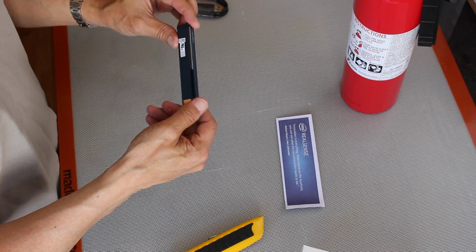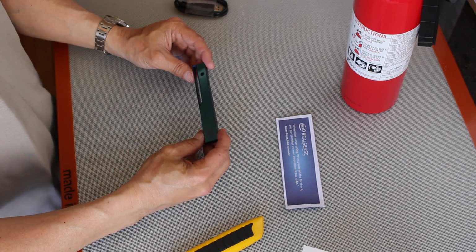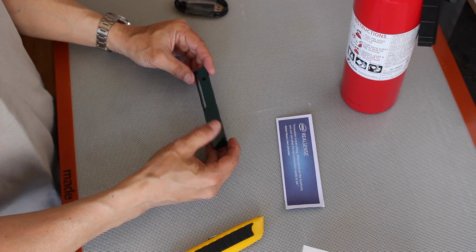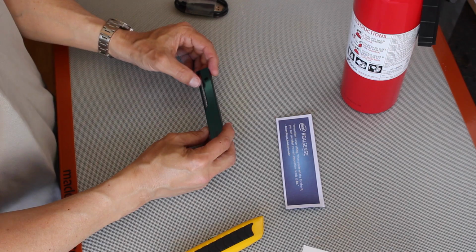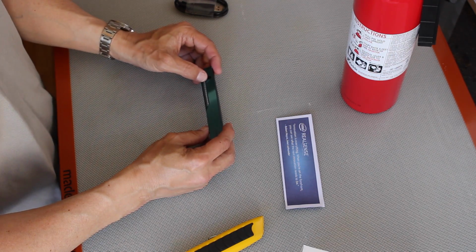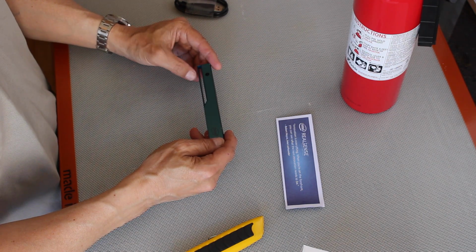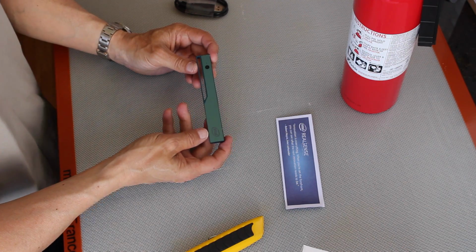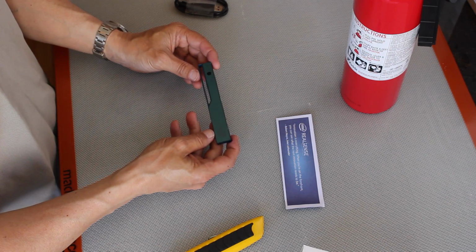It's pretty spiffy looking. My understanding is that there are 3 cameras inside: a left facing and a right facing IR camera, an IR projector, and a RGB camera. The RGB camera is 1080p at 30 FPS, and the IR cameras give you a depth field of 640 by 480 at 60 frames per second. The range on this particular camera is half a meter to 3.5 meters inside, and when you go outside it will see up to 10 meters.